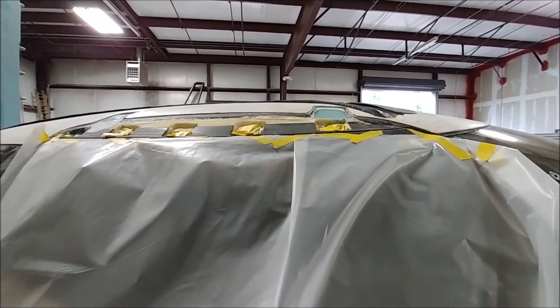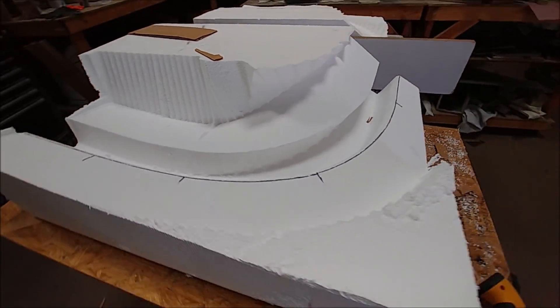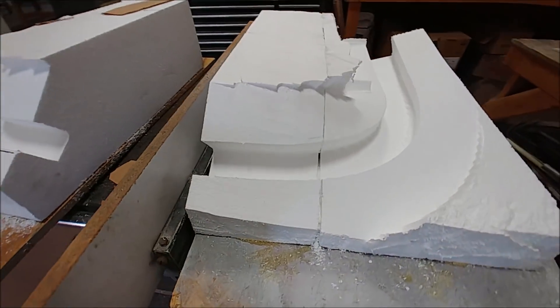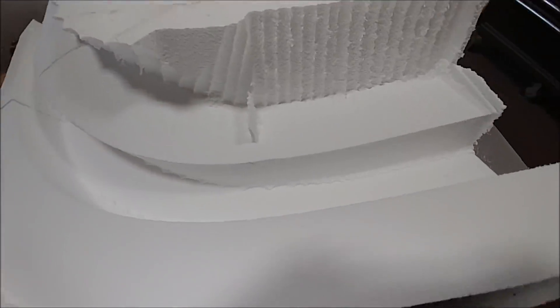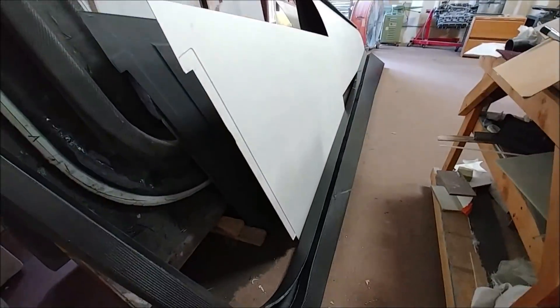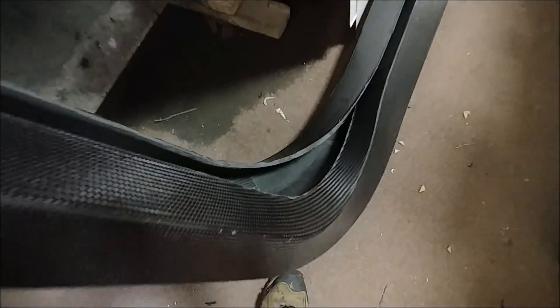There's the upper side of one of the doors — Dan's actually relieved the spots where those hard points are. And there's one of those molds. What we're doing here is just like an instant mold — it has negative draft all through it, so it's pretty much a throwaway. We'll be laying up the part in there and then just breaking away the foam. Those parts actually have to go into the spar to box that radius out in order to make it a lot stronger.